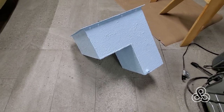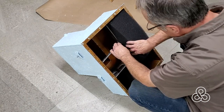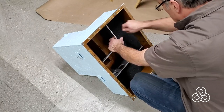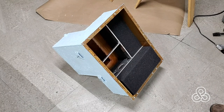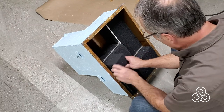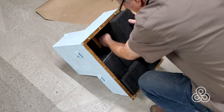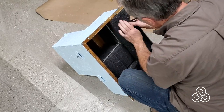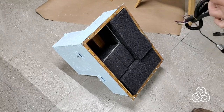Here's the finished version of the coating. Some people ask about foam-filling this tank — this is special foam that's actually manufactured just for this purpose. It is completely open cell and the fuel can move right through it. The only thing is, once the space is occupied with this foam, the fuel moving through it is drastically slowed down, so you don't have any sloshing. The foam fill will go in like this — that one open piece is where our fuel sender is going to fit down into the deep well of this fuel tank.